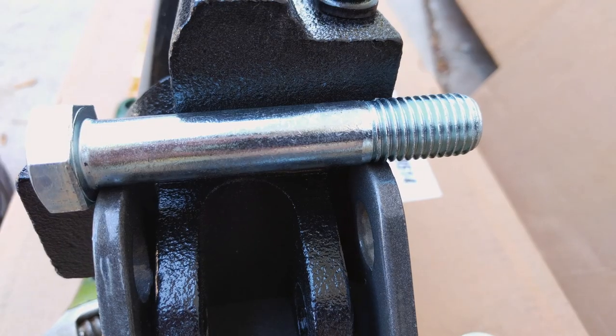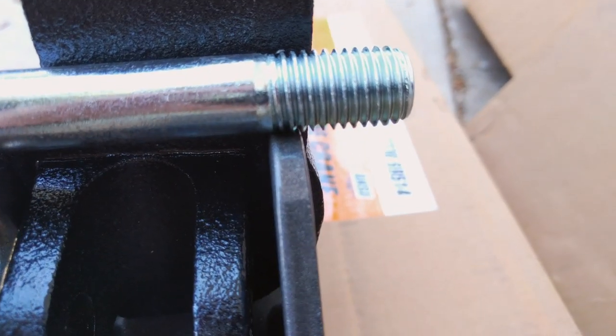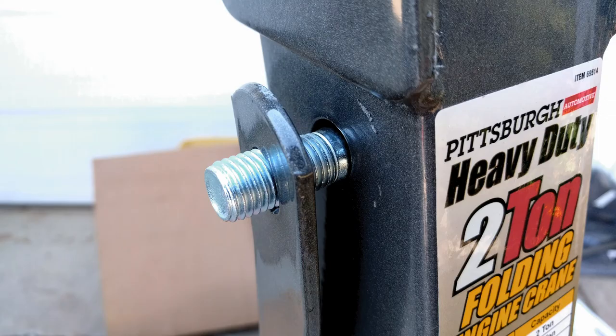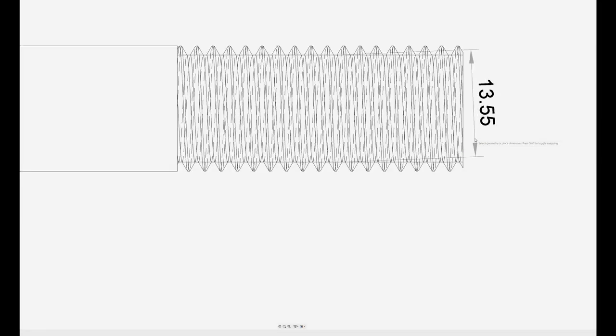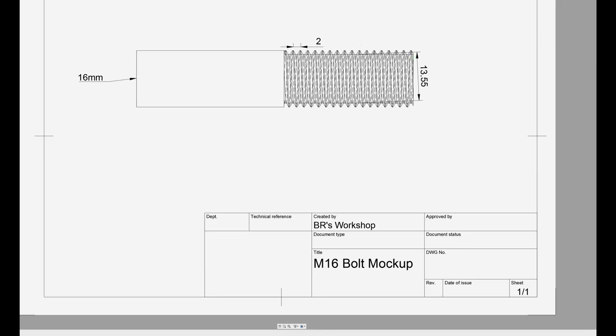There are a number of places where threads are used as bearing points for shear loads. This is generally unacceptable in engineering — the sort of thing mentioned in 100-level courses. There are two reasons for this. First, the cross section or diameter of the threaded portion of a fastener is significantly less than the nominal or shaft diameter of the bolt. The thread root diameter for an M16 bolt is around 13.5 millimeters, or 85% of the shaft diameter — that's a 15% reduction just from poor design.